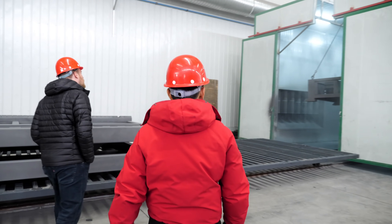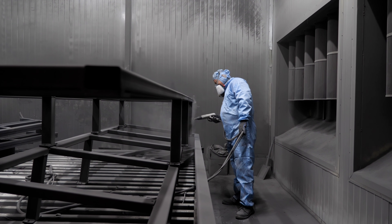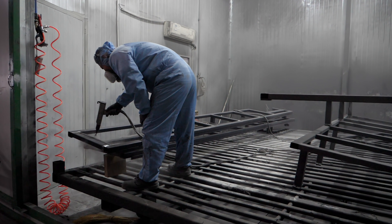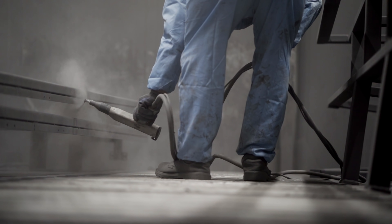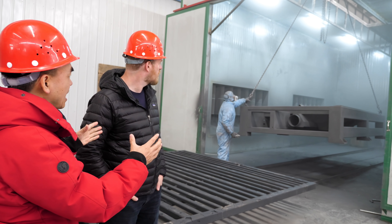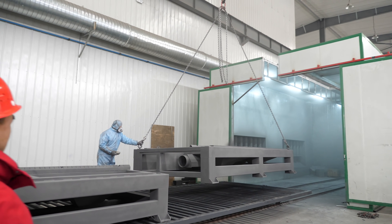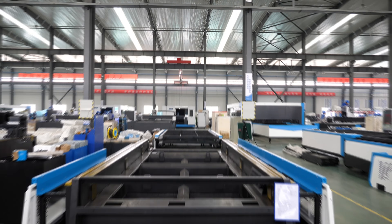What is this? This is a powder coating room — it's like paint. They use a high-voltage spray gun to spray the powder onto the grounded metal. It's a dry powder with a static charge on it that sticks to the grounded metal. After that they use high temperature to bake it on — like an oven. Holy smokes, these ovens are so big! They put the parts in the oven back here. Pretty awesome.